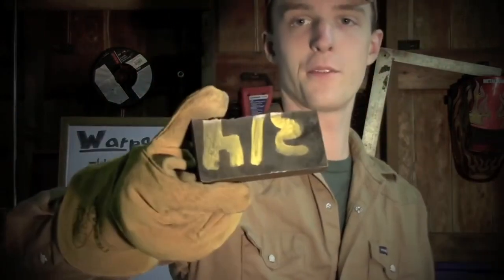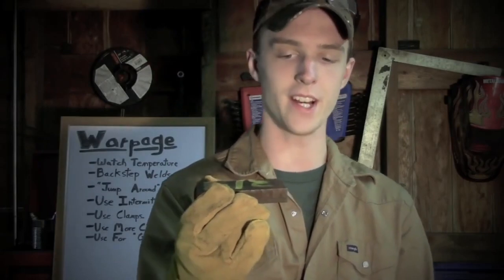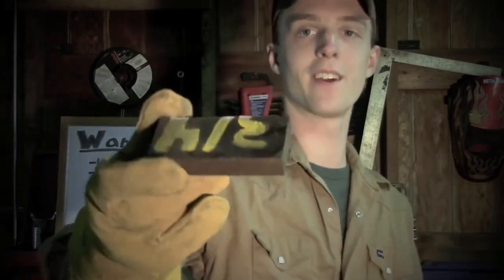Let's take a look at this piece of three quarter inch plate. Let's say you take a piece of metal like this and you have a way to evenly heat it — completely perfectly even all the way through. It would expand evenly in every direction and then, assuming it could cool evenly, it would shrink evenly in every direction and come out not looking much different. But the problem is when you weld something you're not heating it evenly — only the tiny little section right where you're welding and immediately around your weld. Because of that you don't have even expansion or even shrinkage of the metal, and you're left with something that's twisted and mangled.